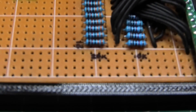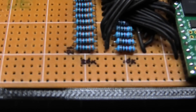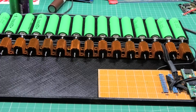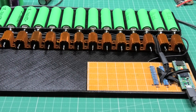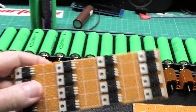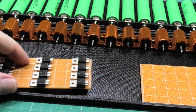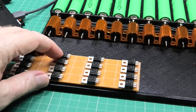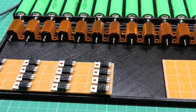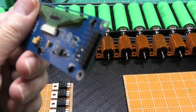These voltage dividers - I think it's 10k and 20k originally, but now I'm on 10k and 33k. I've just released a video and everyone's emailing me. Ultimately what this is gonna do is test 16 cells at once. I've also got these MOSFETs - I think they're N-channel - which I've still got to finish off. I don't know whether to use this OLED display - depends how many pins I've got left.